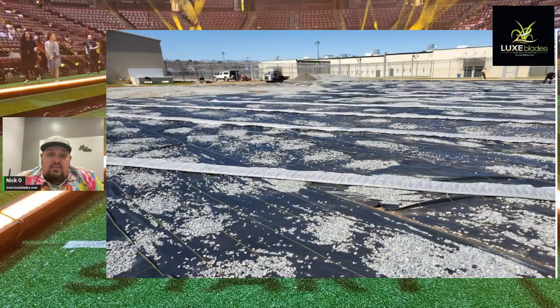And then here on the bottom, you'll see a little bit of dirt showing. We actually pull those wrinkles out, but we'll put a geotextile fabric down first. What this does is it's basically adding like 5 inches of soil, or of rock. That's how great geotextile fabric is for the soil, for the compaction, and everything. Also, when you're compacting your rock, you're not losing it in the soil.